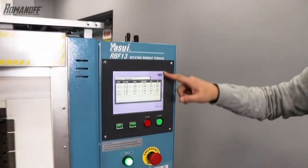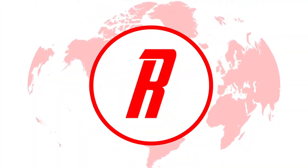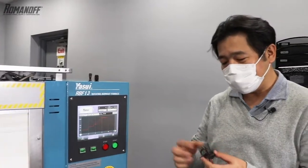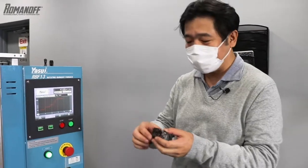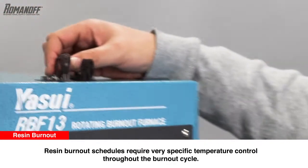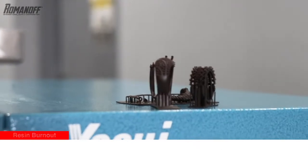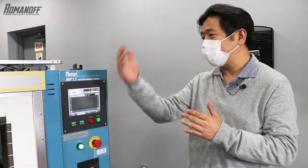After you press OK, you check the ramp and the cycle starts. In today's casting, most people are using some kind of resin — either from a printer or a prototyping machine. Any kind of resin drains totally differently from wax. This resin has a thermal expansion at a certain degree where it is very difficult to drain, so not only the precise temperature but a rapid high elevation time to a higher temperature will play a very important role in the casting result.